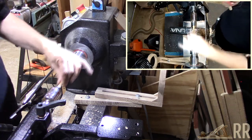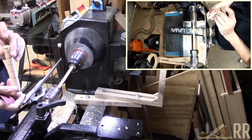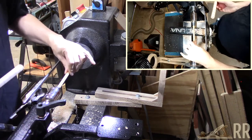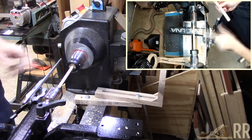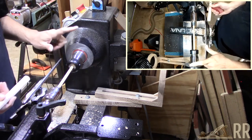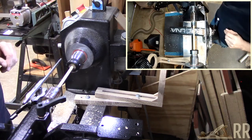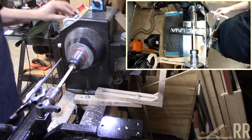So in order to fit the slider into the whistle, I found that I actually have to sand it down a bit. The drill bit does too good of a job in making a nice straight hole. It needs to not fall out, but you need to be able to move it up and down. And right now it's quite tight. So I mounted a small chunk of dowel the size that I need between a collet chuck and a live center with the point removed. It should give me a little bit of pressure just to keep it from whipping around as I sand it down a bit.